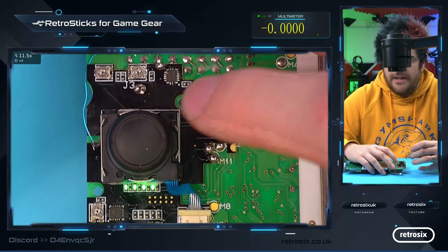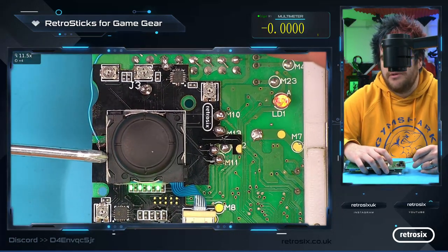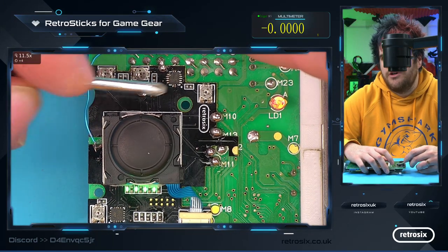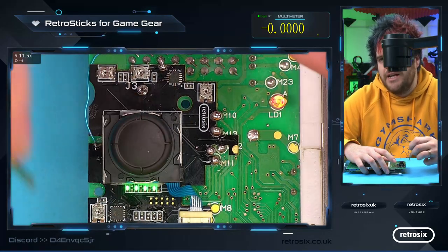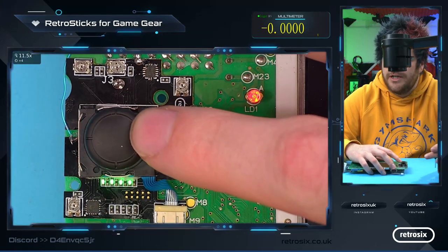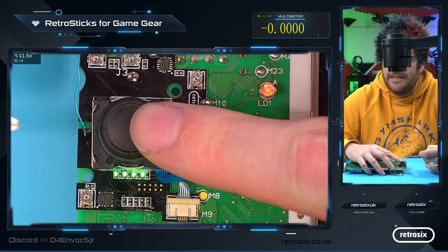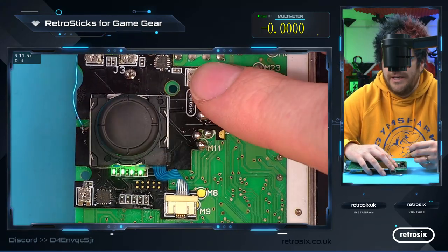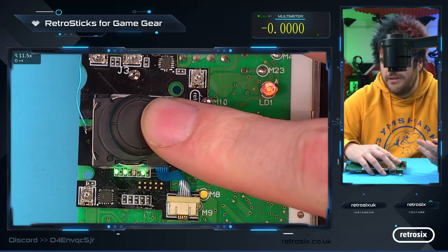And the idea is going around, at least the potentiometers are in position for the most part. So it starts here. So this one is the left potentiometer. This one's the top. This one's the right. This one's the bottom. So it's generally in a ring. So we want to first adjust the left thumbstick so it comes on. The lights come on when it's centered and not being active and go off when effectively the button will be pressed. And that's just because of how the buttons work. They are active low. So when the light goes off, it means the button's pressed.